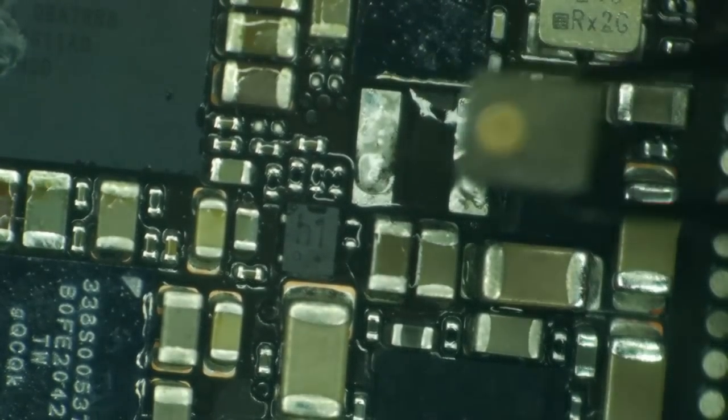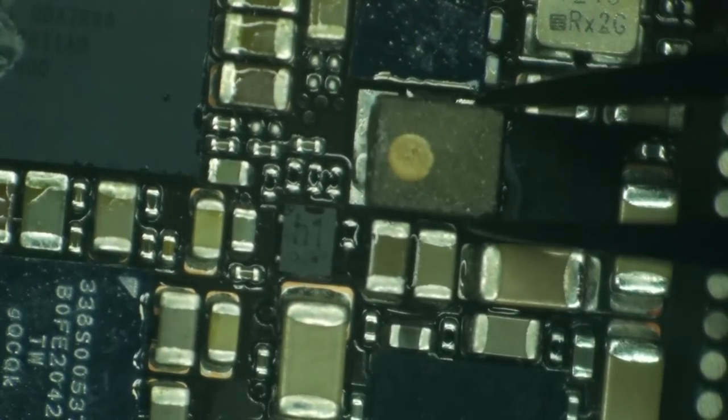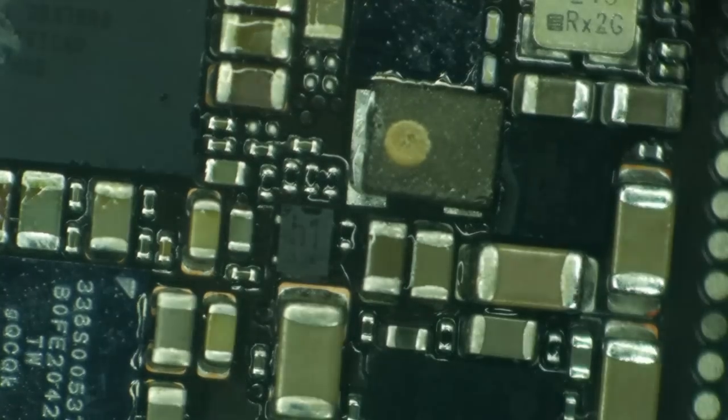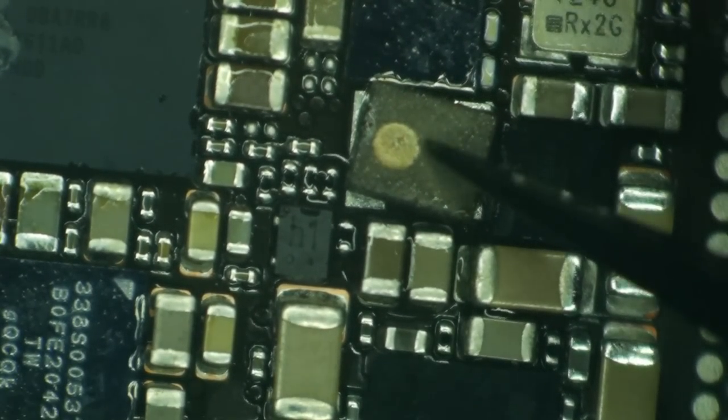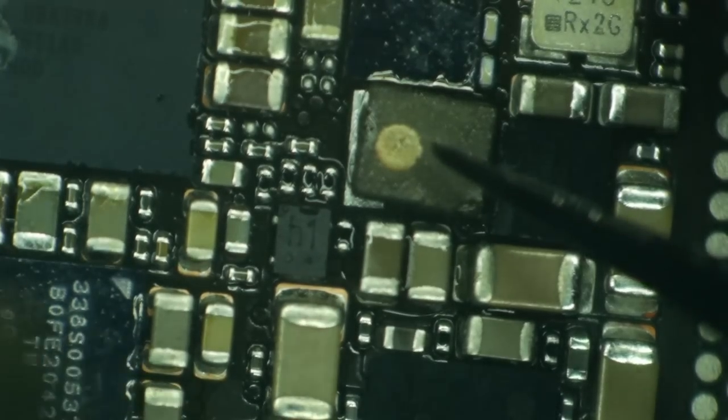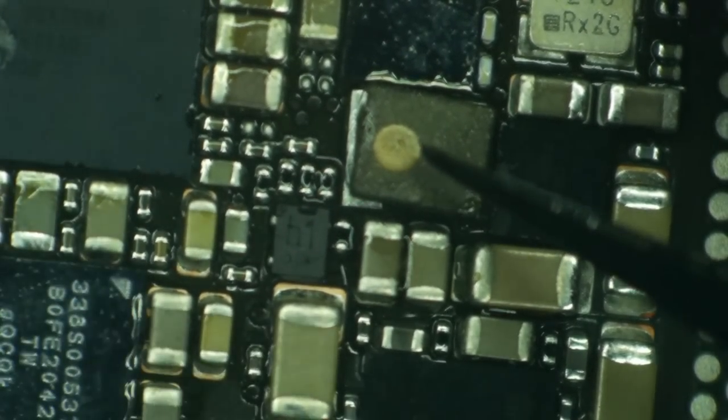See, if I put this coil on a board that I know works, that I've just transferred data off of, and it goes back to being 70 milliamps brain dead, that means I potentially did an entire board swap for nothing.